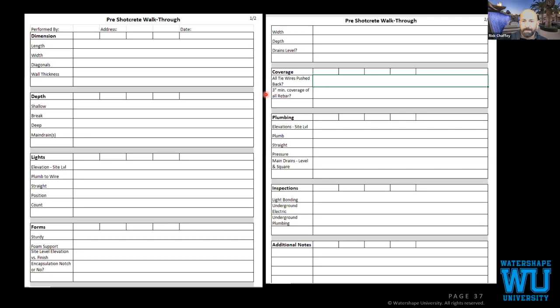And then when we do any pool that's got a lot of tile in it or all tile, to Joe's point, you don't want lights off even by an inch, because that nice 2-inch grid you put on the entire pool identifies every mistake you've made in the project, right? Because every pool light is either going to fall above or below a grid line. You want to make sure all that stuff ties in nice and tight. Yep, exactly. Until Twinscape came out and said, yeah, this is the correct size, I had some anxious feelings. So I slept pretty well that night.